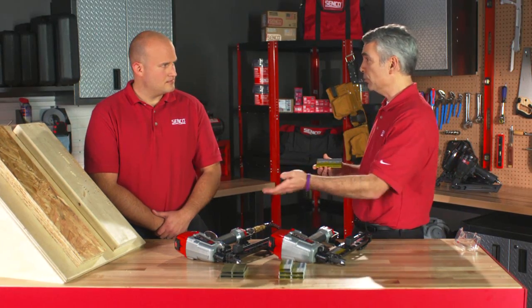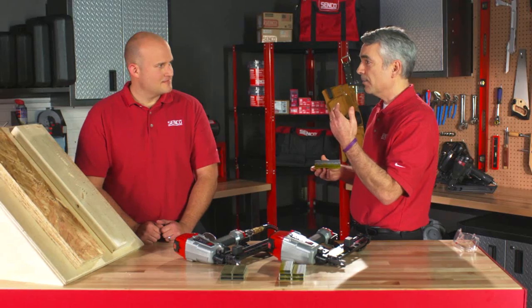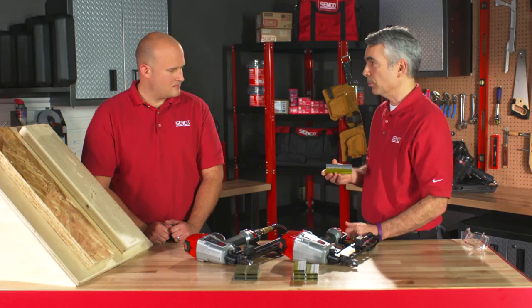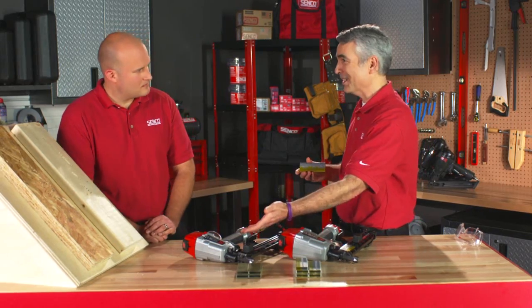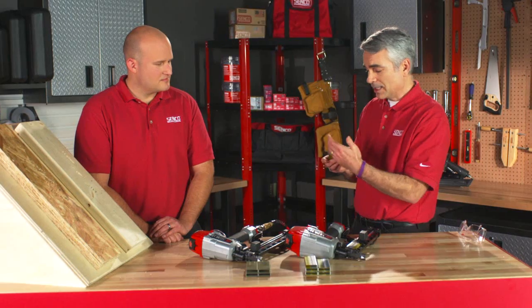Low shear values help the tool — it doesn't take a lot of energy to pull off the nail or the staple, and it stays on your driver blade. Secondly, as we get into some harder and harder substrates, that energy that you use for your great tool needs to be for what it's made for, which is joint connection. So you're not expending any energy picking off this staple.